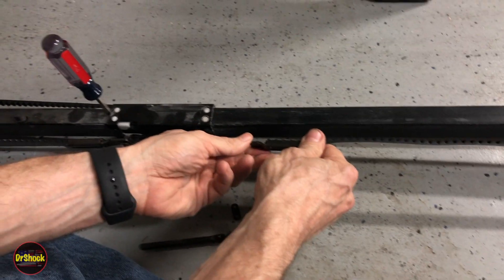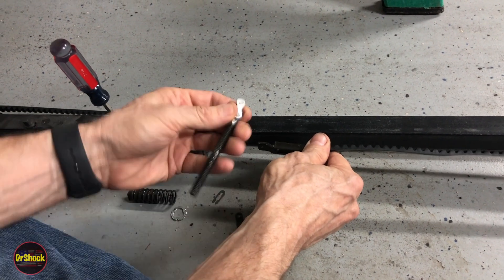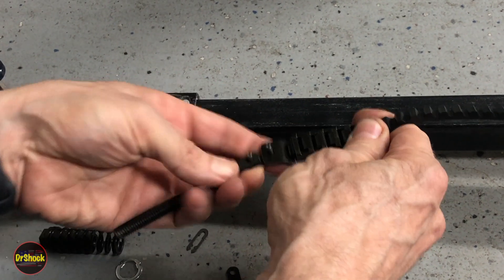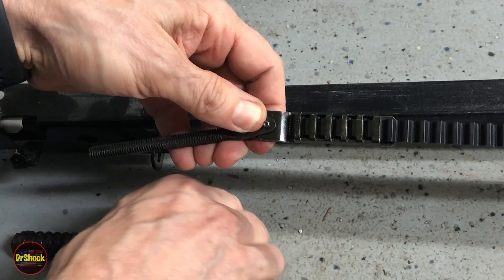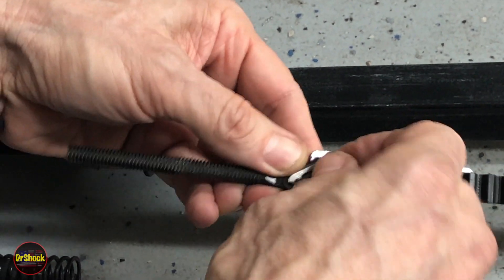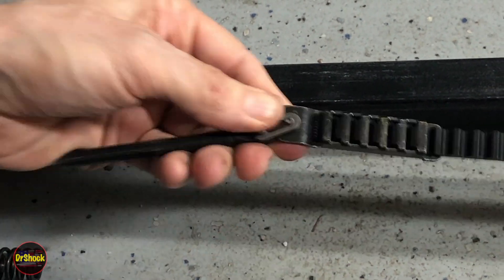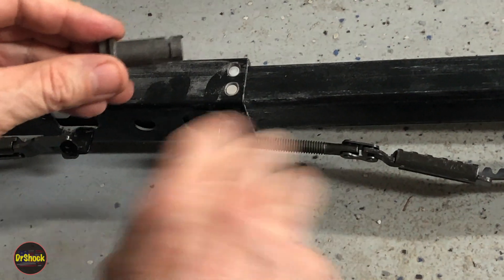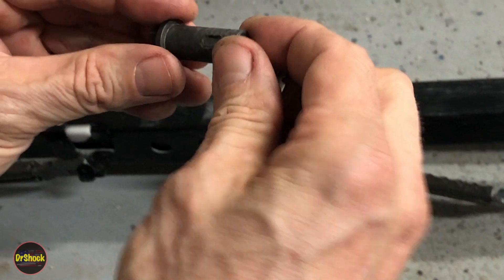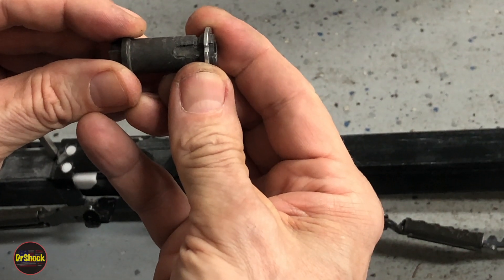Pull the belt a little tight, making sure the ribs are all facing the right way. Remember what the manual said about the flat side - this is the side with the ribs, the other side has a little bend in it; the flat end goes like this. Take the screw and the link and push it through, then rebuild the link by putting the end piece on and putting the spring back on to retain it. Here's the nut ring - it has notches cut in it, and those notches fit into the tensioner for the final tension adjustment.